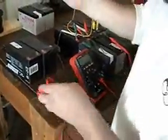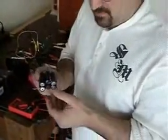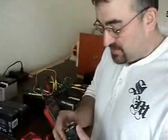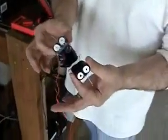If you do the same thing with capacitors, a little disclaimer here: if you mess with capacitors, you do so on your own will, of your own volition. I don't assume any responsibility for anybody who hurts themselves with capacitors — you can burn the crap out of yourselves. These are 50-volt capacitors each. What I've done is put them in series-parallel, and you can charge this little bank of capacitors up to 150 volts, somewhere in that neighborhood.